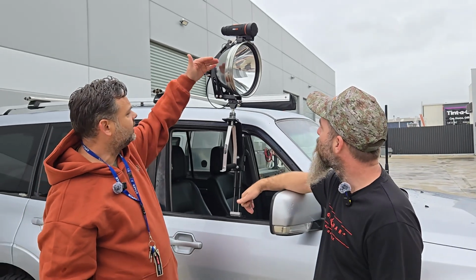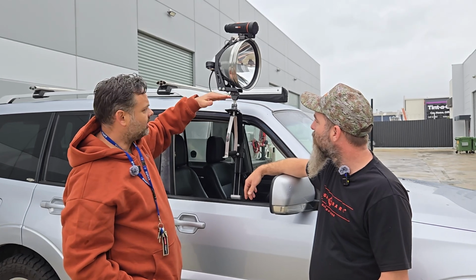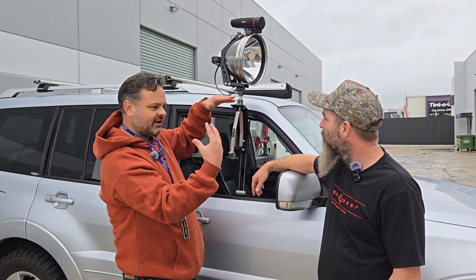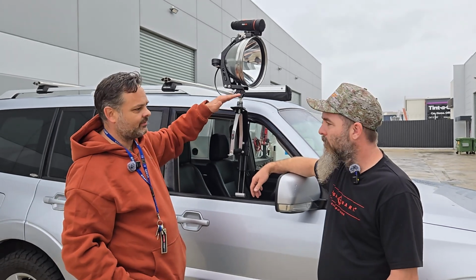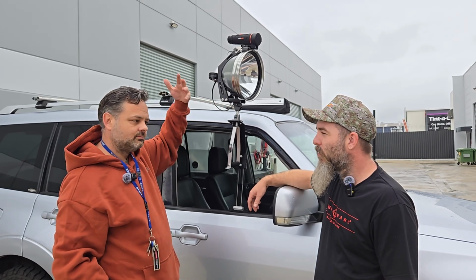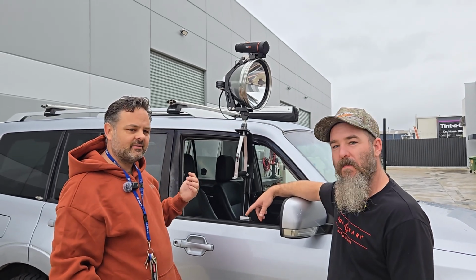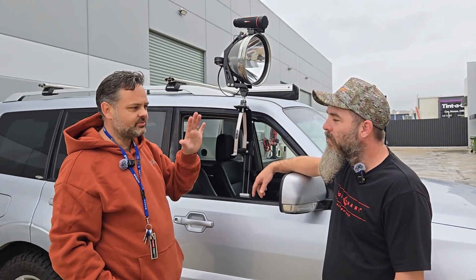Yep, correct. Or, if you've got your thermal mounted down here out of a side bracket, to align it, it's actually got to point up, and that introduces atmosphere, which overwhelms the sensor, and the picture is compromised and gets washed out. It's so much more, what's the word when it's affected by atmosphere? Now, if you don't know what we mean about atmosphere, jump on one of our other stock casts where we explain how atmosphere interferes with thermal.